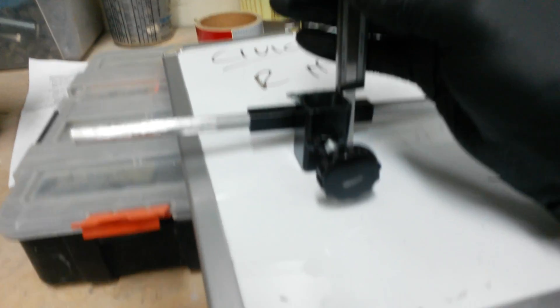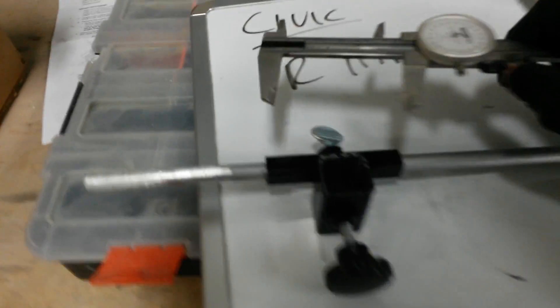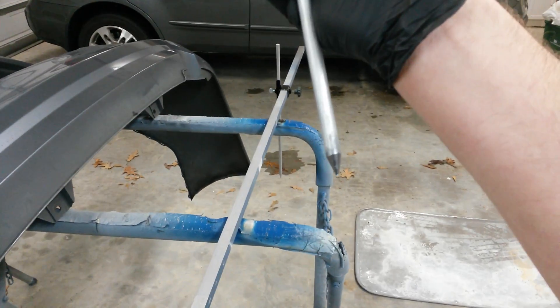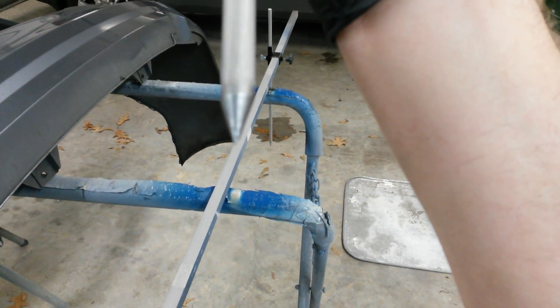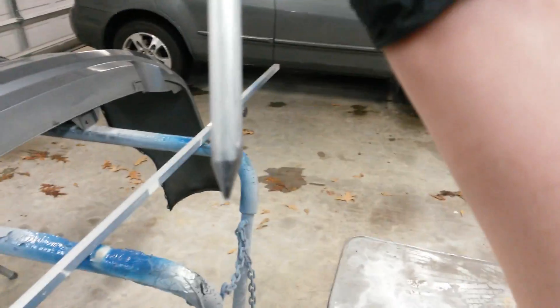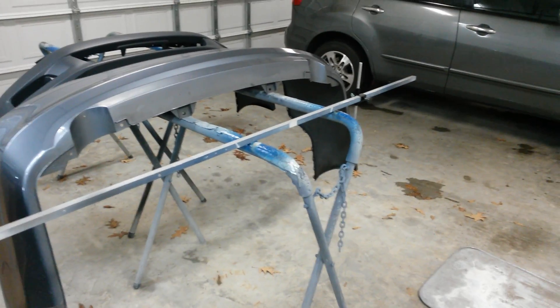The sliding tube section is approximately an inch and a half long, and I wanted it fairly stable so I put a little more length — almost three inches. I had four pointers made; basically it comes to a pencil point so it'll drop into just about any hole. A half-inch bar would probably be better since some holes are a little bigger and the whole pointer drops through, so you can't completely center it. But for the most part, this has worked for just about everything I need.